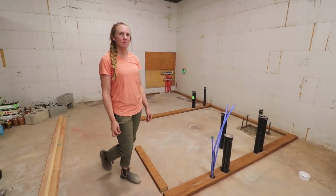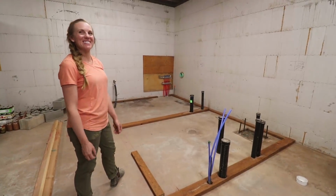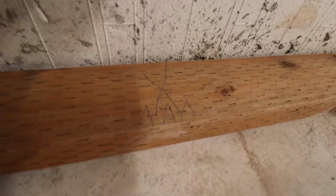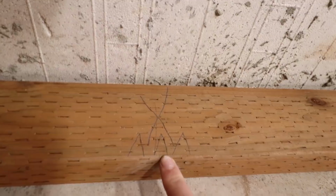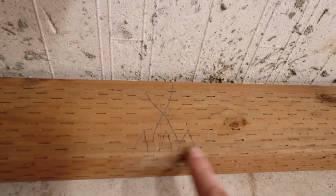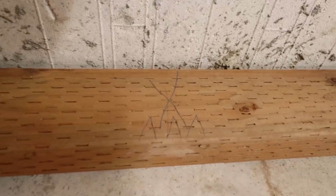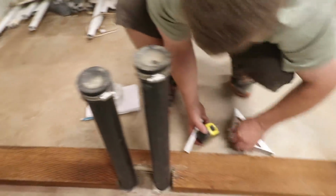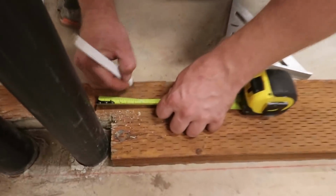Awesome possum. All right, are you ready to explore and play stick framing? I am. I'm excited to do this. Jesse's teaching me how to mark where your studs are going to go. I marked the center, and because this is 2x lumber, it's 1.5 inches total. So from center, you go 3/4 inch that way and 3/4 inch that way, and put your X. Boom, studs. Oh, you're doing yours a lot neater than mine. You're doing actual lines, huh? I can reach it. You probably can't because yours is against the wall.